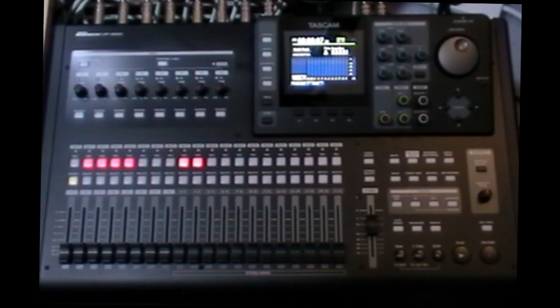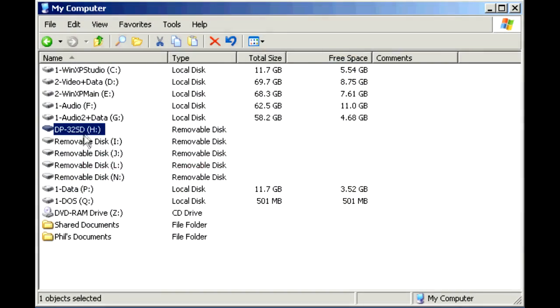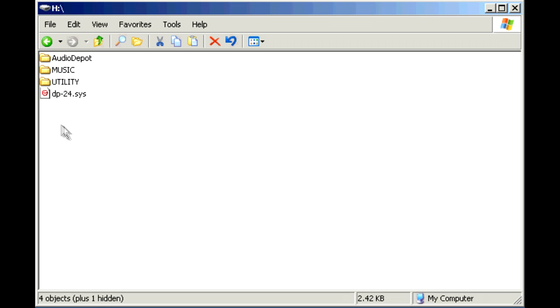So to summarise, when you press record, one or more files will be created on the card, and these will grow in size until you press stop. And when you press play, the files are read back from the card and the streams of numbers sent along the playback path. And the files are standard WAV files, so they are compatible with computers.